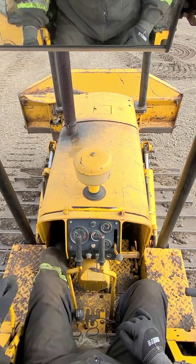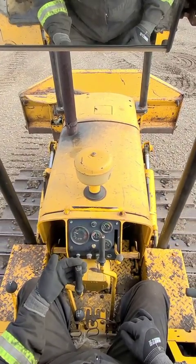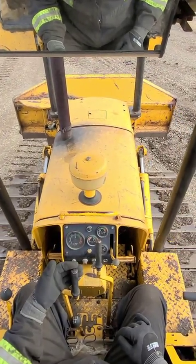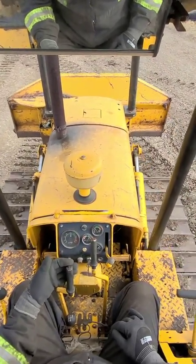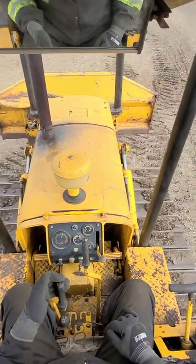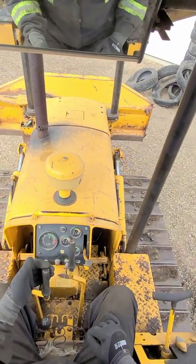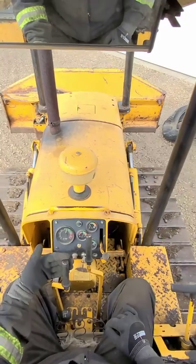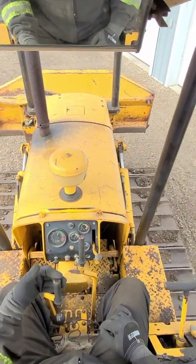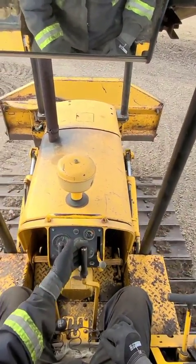That's a simple forward and reverse. Let's make some corners. Going forward, disengaging the left-hand steering clutch — the machine is making a slight left-hand corner. It's very slight; the ground's really hard here, so it's basically rolling on the right-hand track which is just powering it. Applying the brake as I am now actually causes it to steer. If I was pushing a heavy load, just disengaging the clutch like that would cause it to steer a little sharper. So it's really traction and load dependent.